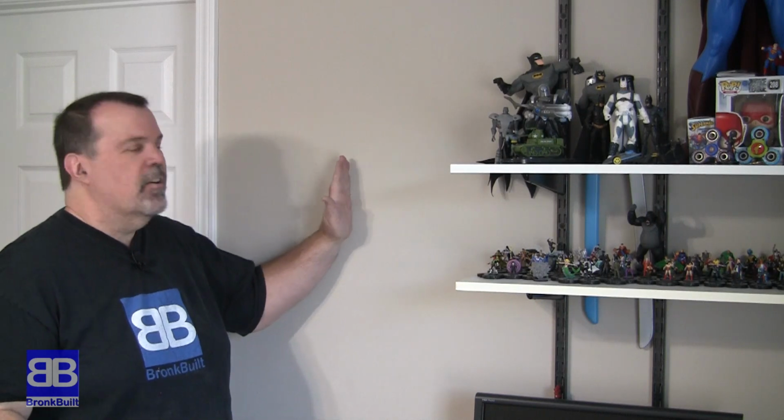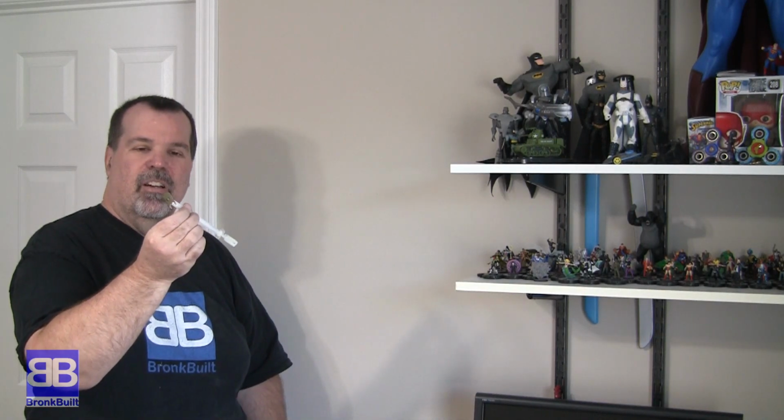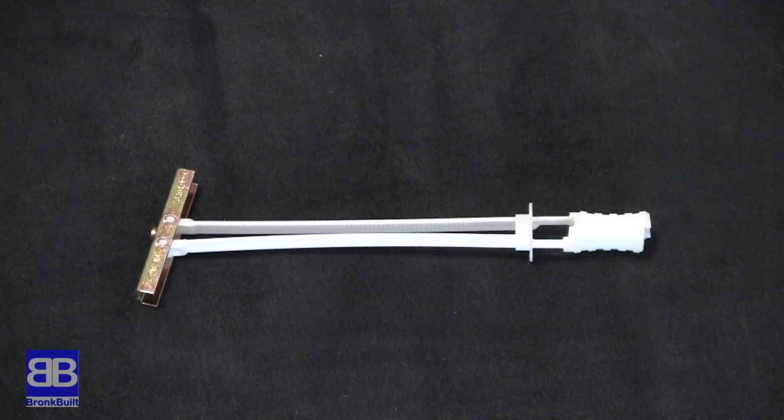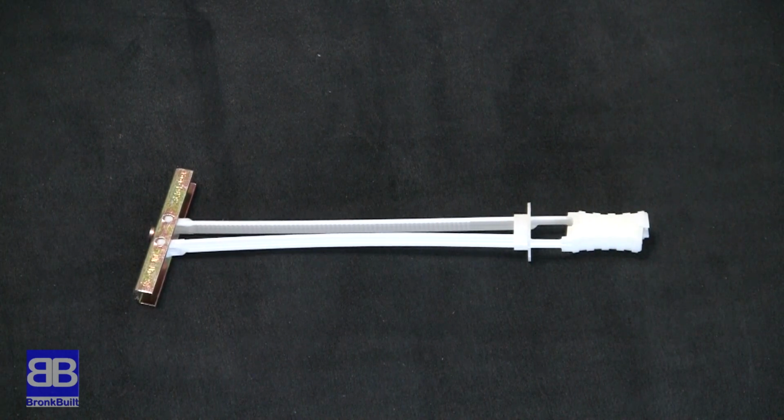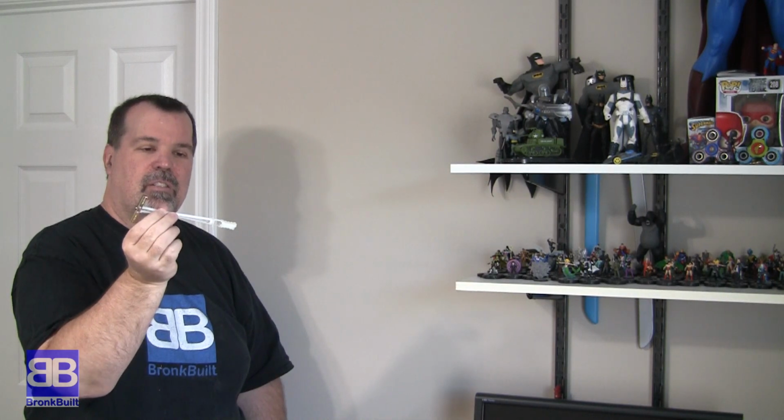Well, Christmas is over. My son opened the gift and he did really like it. We decided this wall here in our small game room is where he wants to display this sword. The problem is the sword is about 11 pounds and so is the plaque that will hang the sword. There is no stud behind this point right here, so I've got these little guys here and they're supposed to hold about 200-250 pounds. So I'm going to be using 2 of these as wall anchors in the drywall, and we'll see how that goes.